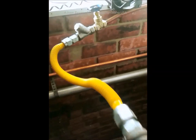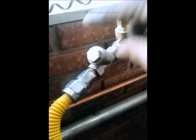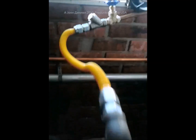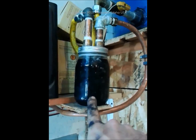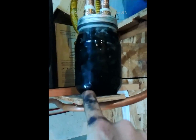I would get stoppages where oil would get trapped in this valve, so I decided to put one of these in — it's stainless steel and it has a strainer in it. You can take that off, turn this off, take it out, and clean it, which is excellent. I found everything from grass and leaves to bark in some of this oil I got for free, and even when you strain it, it just was not being very successful. I put this down here at the bottom to make sure if it was to drip. I had to put a little shelf in because it got a little heavy and was pulling on the copper — I don't want it to tug on any of these fittings, so I strapped it off.